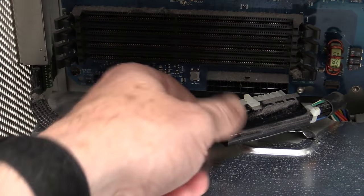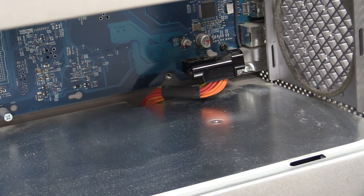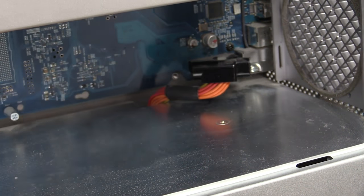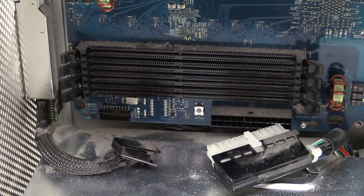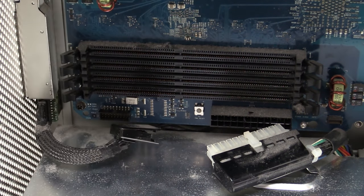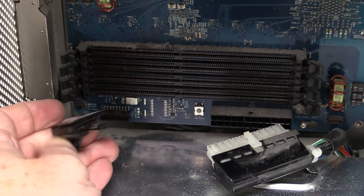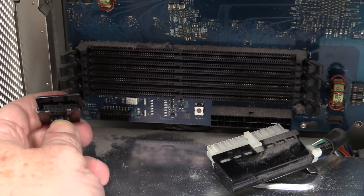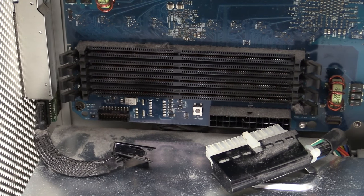So I took the memory modules out, and there's the big Molex, or one of them. They've actually got two of these, as I sent one over that side as well. I got that one out, and there it is. So I'm sure I can get the pinouts for these babies somewhere. I have to look that up. And then from the front panel, they've got this. This is like the power connector. It's got a USB and a FireWire and an audio, I think. And that's just some little weird smaller pitch one. You can still get those, though. But, you know, that's really annoying.